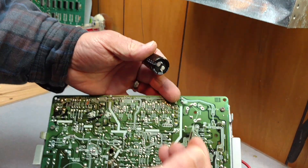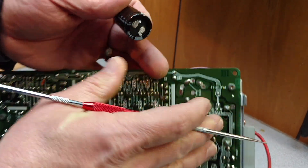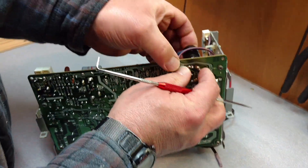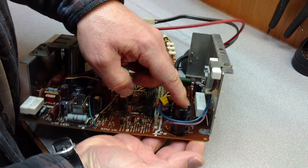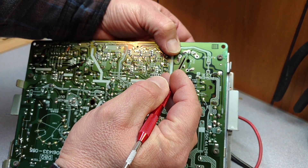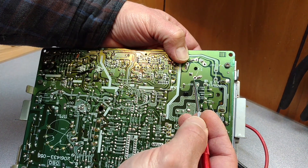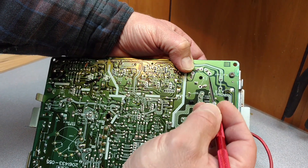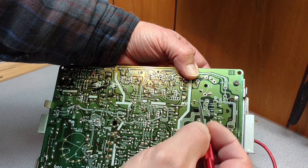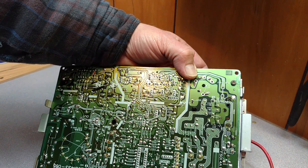What we're going to do is take this and actually put it in the positive hole and this island over here, so it'll sit a little better on the board. These smaller ones allow it to actually fit in there and they still sit on the board so they don't hang off. It'll fit between here and here, and then what we have to do is bridge this lead to the ground, to the negative here, and we'll actually make a wire to go across there to bring that over. Then we just fill in these other spots. We're going to solder on here, so I'm going to remove all the solder off there so we have a good brand new solder joint.